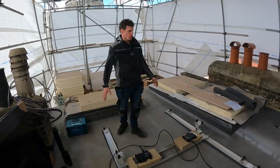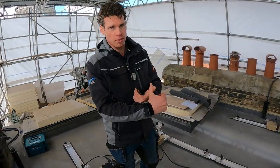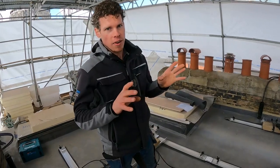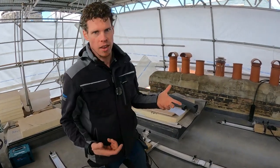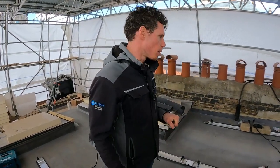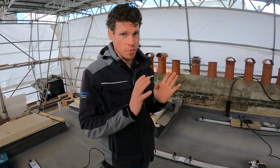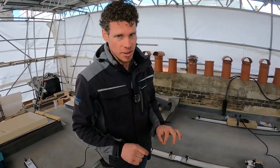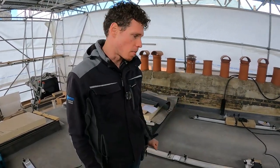This is our rail system with solar panels. There are three main types of mounting systems: an in-roof system, an on-pitched-roof system, and an on-flat-roof system. The flat roof system is what you'd call the low-hanging fruit in the equation, because as you'll see as we go through, it's so easy once you start getting everything squared up. The mounting system lines up, the ballast goes on, and everything just falls into place. For our first Enphase installation on a flat roof, it frees us up to familiarize ourselves with the system a bit more.